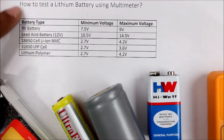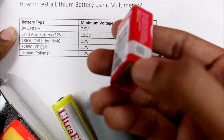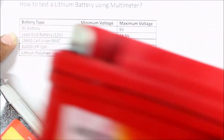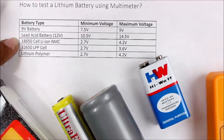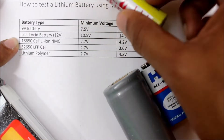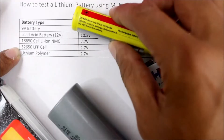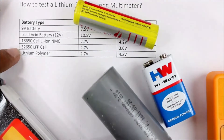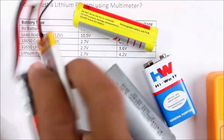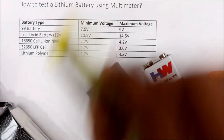There are many types of batteries. The first one is a 9-volt battery, which many of us would be familiar with for projects. Then we have a 12-volt lead-acid battery, commonly used in bikes and cars. The third one is an 18650 lithium-ion cell, and the fourth is a 32650 — also a lithium-ion cell but with different chemistry: this one is NMC and this one is lithium ferrous phosphate, or LFP. Lastly, we have lithium polymer cells, which also come in packs.